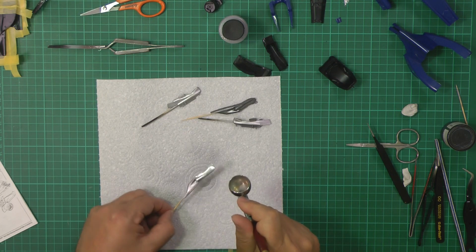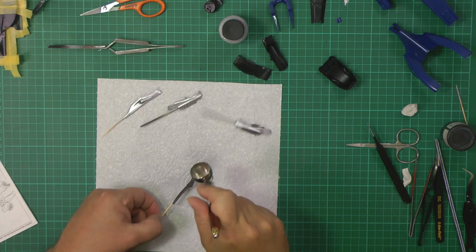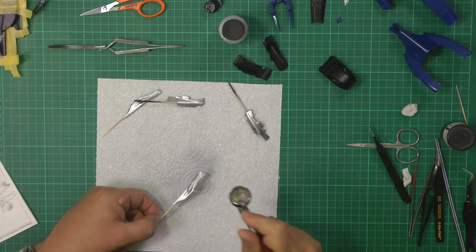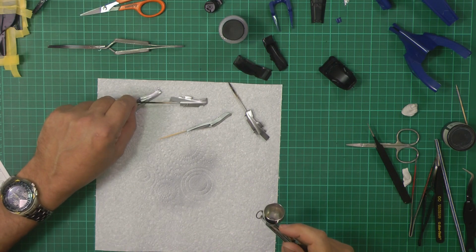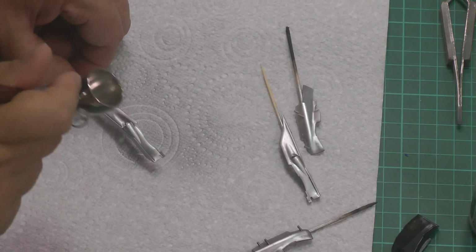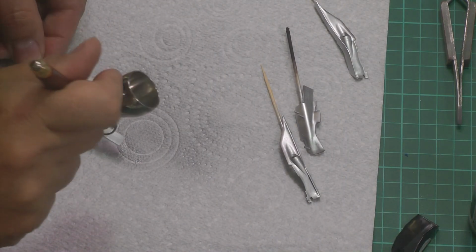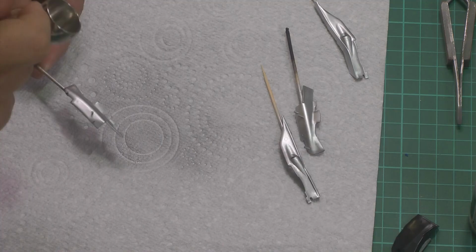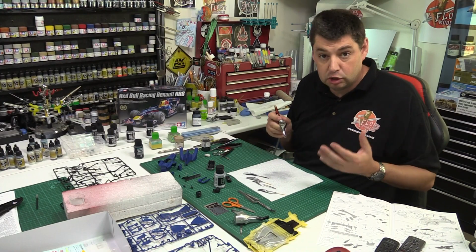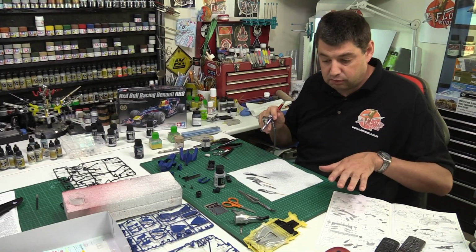And I do like this colour. It is very nice, and we'll show you in a moment with a couple of parts we've already done. But it's probably the best acrylic metalizer finish I've used, purely because it's got that sort of almost pearlescent look to it. And once you've got a coat of this down, or it's on a good coat of primer, you can actually hit this quite hard. I mean, you can flood it, it tends to self-level, back off.